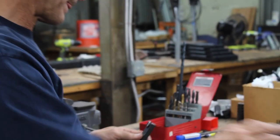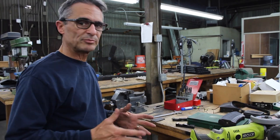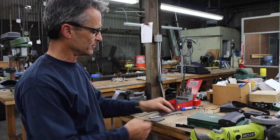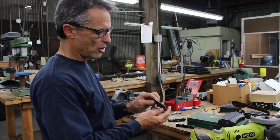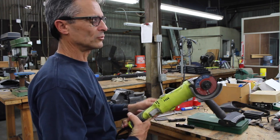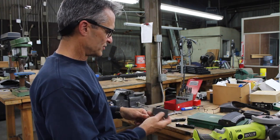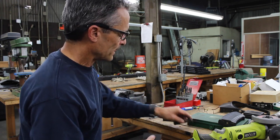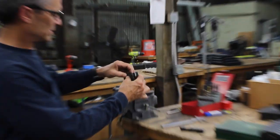So that's our goal today. We want to show you how to inexpensively and accurately remove those flares with nothing but a vise, a piece of bar stock, and a hand grinder with a cutting wheel — not a grinding wheel, but a cutting wheel. So the first thing you do, you pick up the bolt and you take the bar stock and you place it on the bottom of the mag and load it up into the box.